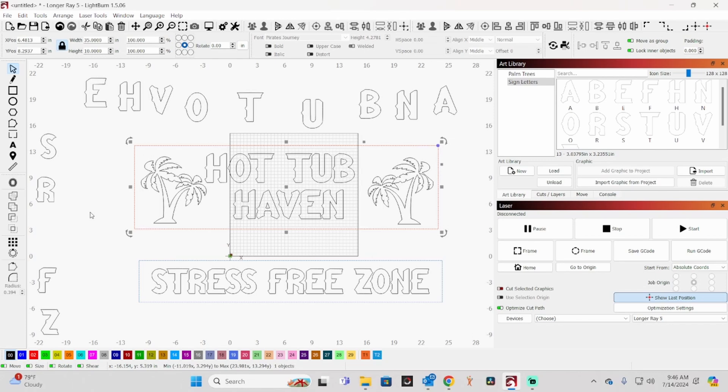This toolpath is sized to be the upper sign, which is 35 inches wide by 10 inches high. The lower part of the sign, which will hang from hooks, is 35 wide and 5 inches high. I needed to get all my letters and everything to fit in there. This particular font happens to be called Pirate. I typed out what I wanted, got it centered, and sized the letters: 3.5 inches tall for the upper sign and 3 inches tall for the bottom sign.